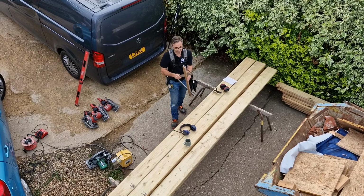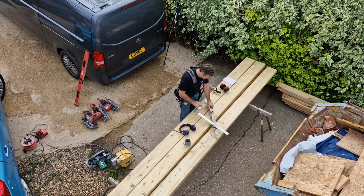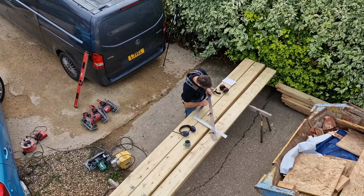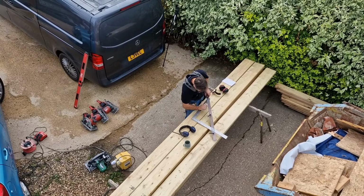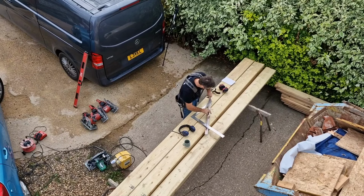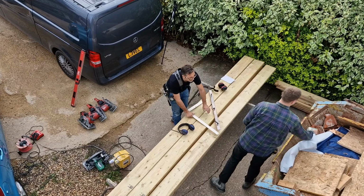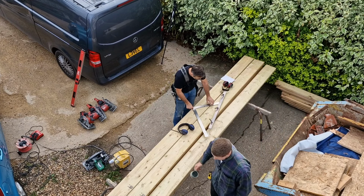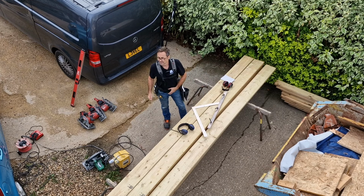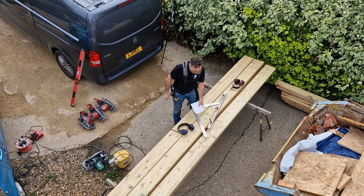Well, the first thing that we're doing is getting our roofing squares set up, and we'll do a quick calculation to see how long the longest rafters are. And then that'll be pucker. You're going for 33 average out, or are we going? I think it's best to go 32.5. 33, because you'll find if you go 33, that extra half a degree will mean that everything's nice and tight on the points. So you've got to make an approximation sometimes, you've got to make an assumption sometimes.